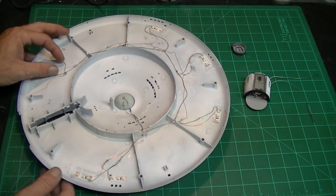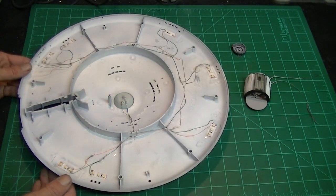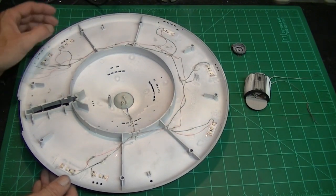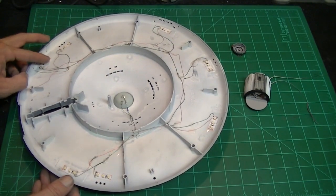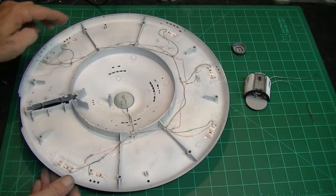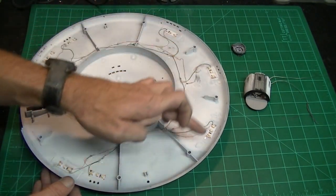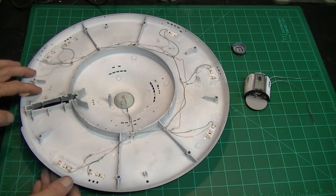There are two basic circuits that a lot of people use for wiring these models, a type called a series and a parallel. Basically, a series circuit is where you run a chain. If I was wiring these up, I'd have a wire connecting from the plus to the minus to the plus to the minus, and so on all the way through, so that we basically had a chain of power going through each one of these LEDs, starting off with the power that comes in.